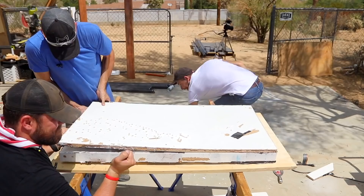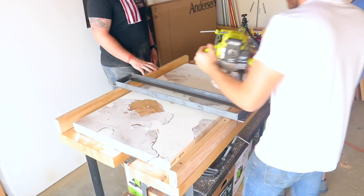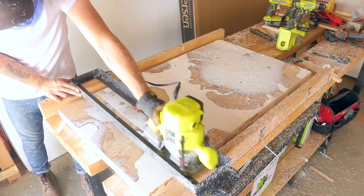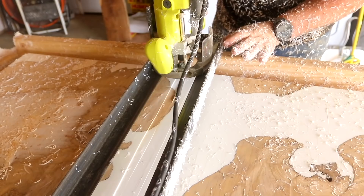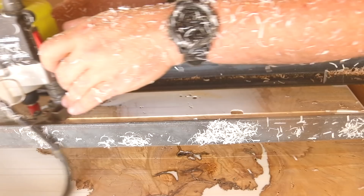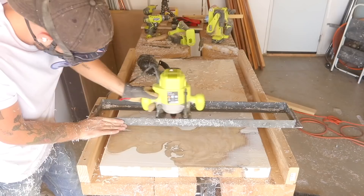We let the epoxy cure for about two days, then John and I used a router sled to flatten it. The idea of a router sled is simple: first you level and glue down your tabletop with hot glue, then you have some rails that a router with a flattening bit can ride on. After multiple passes gradually lowering the bit, you reveal a really clean slab that is perfectly flat. The bit I used was a 2 inch by 3/4 inch double flute straight bit from Diablo — they do make dedicated surfacing bits, but they're expensive and do the same thing. The epoxy when cured planes very nicely and sands easily as well.